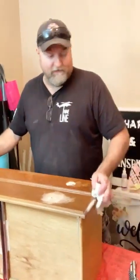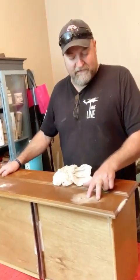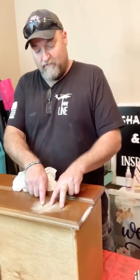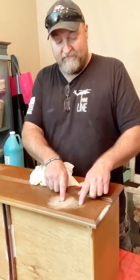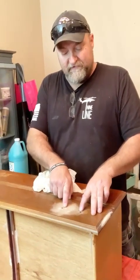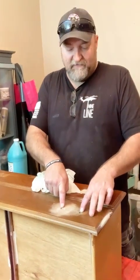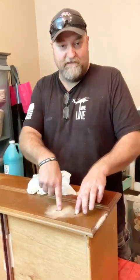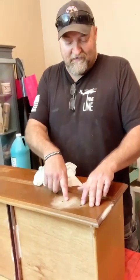I can tell you how, though I don't have the drawer in here. On the top drawer, the holes are actually 2 inches apart, and we're going to go to 3. So we're going to do the same thing, but instead of just moving over a half inch, I'm going to fill both holes and move outside a half inch on each one. It's a little bit more challenging, and you have to be careful when you move. I like to make sure that I'm moving a half inch or more, because if you're moving less than that, you run the risk of drilling into the old hole and splitting it. And then it becomes a pain trying to fix that hole, and it can get ugly.